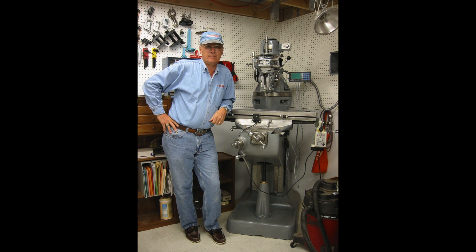The Bridgeport came with a sort of homebrew one-phase to three-phase rotary converter — an idler-style arrangement with a large heavy motor. The owner also offered me a free replacement C-faced single-phase motor, an aluminum mounting plate, and a few Morse taper collets: a half-inch, a three-eighths inch, and a one-fourth inch. I took the collets but passed on the motor accessories, knowing I would power the mill with a VFD — a variable frequency drive — which saved me hauling away two extra heavy motors.